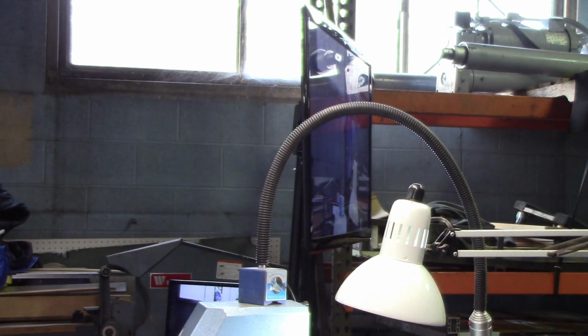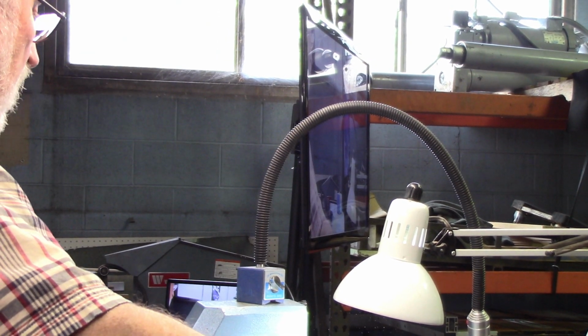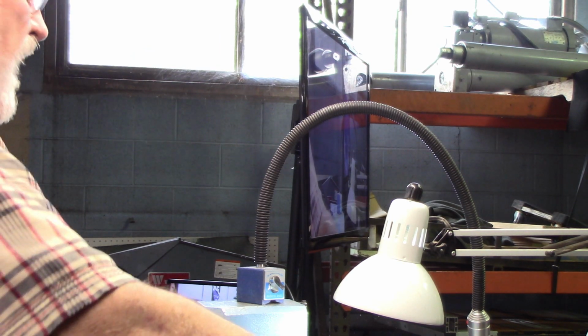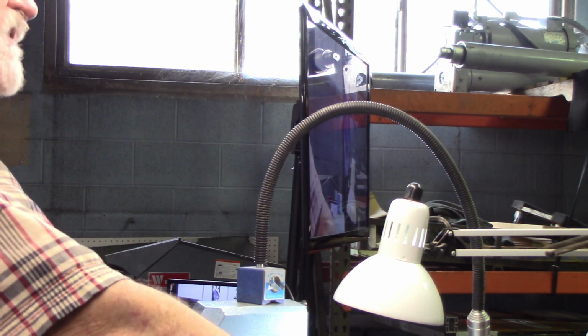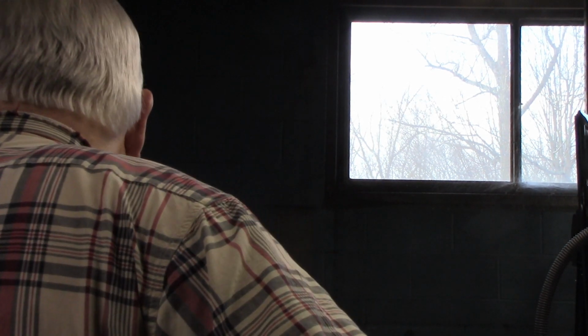Most of the ferrules that you buy on your tools are generally brass. That's traditionally what they used to use. Brass pipe is difficult to find, so a lot of people are going to copper plumbing fittings, and they work just as well. They just don't look as traditional as the brass does. I was lucky, one of the guys from the Erie Club had a bunch of brass pipe that he bought, I don't know, he's always going to auctions and buying all kinds of junk. And he bought a bunch of brass pipe and cut it up into 7/8 to 1 inch sections and reamed out one end of it after he cut it, and they have them in the tool cabinet up there that anybody who needs some can just grab whatever they need. And so it makes a nice source for that, because brass does look better.